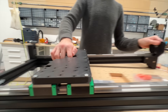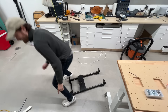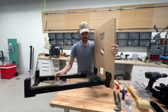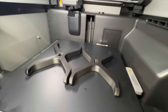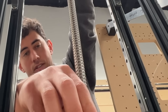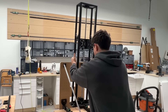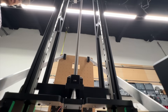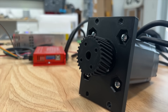Look at how beautifully this thing slides. After a strength test, we got back to building the z-carriage, which is made up of four 20x20 aluminum extrusions stiffened with 3D printed brackets and actuated by a 1200 millimeter ball screw. To cap it off there's another very thick 3D printed plate. The z-tower gets mounted onto the linear sliders in the y-assembly, which is incredibly satisfying to move. After a quick motor test — by the way, this is the biggest motor ever used on a project to date — Mark and I hoisted the sliding assembly onto the wall and screwed it into the sliders on the gantry.